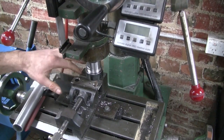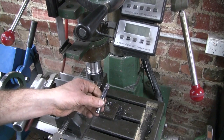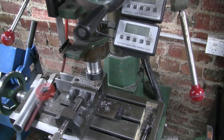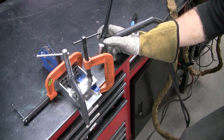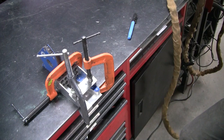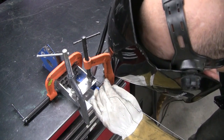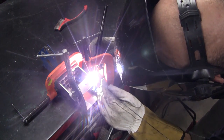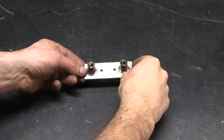Unfortunately the bulkhead is at a bit of an angle, so I need to overlap these holes to get this plate angled on the fittings. The biggest carbide end mill I've got is 12mm, but I've found this old high-speed steel end mill in the bottom of my drawer — it's the right size, let's see if it lasts. Another over-complicated welding jig has been created. All set up, time to weld. And whilst it does warp really badly, it is beautiful to weld — if you put the gas on. Disasters have been averted, that's come out quite nicely.